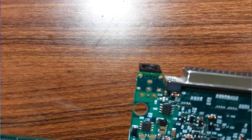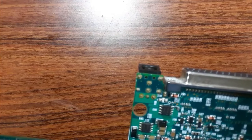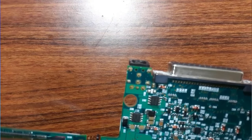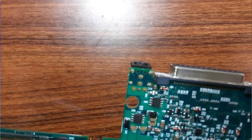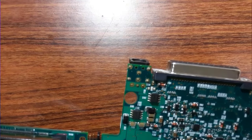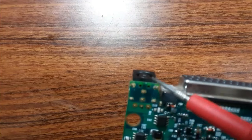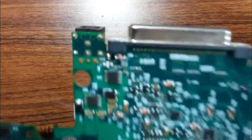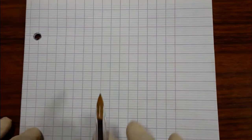Always the power jack has two terminals: the positive terminal and the negative terminal. In some motherboards you can find three terminals — positive, negative, and identification pins. For example, Dell laptops can have three terminals in their power jack. For this motherboard we have just two terminals — the positive in this hole and the negative here.